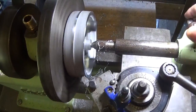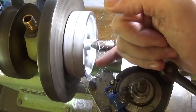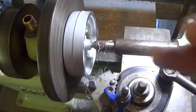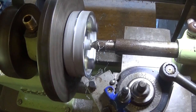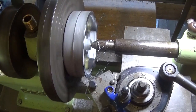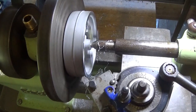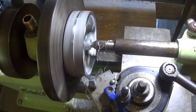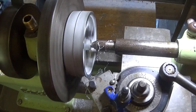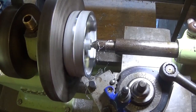I've cleaned up the outside and my boy was right — castings are beautiful, they machine like magic. Just zinc aluminium. I've trued this up but I'm truing the face up and it's got a bit of a peak in the middle. This shape is because of the draft angle for the casting — the pattern is cast in two bits. If you haven't had a look, go and have a look at Myford Boy's videos about casting these castings. They're fantastic videos and they show you pretty well what the process is that he goes through to make these castings. They are quite involved, and they explain the shapes and what they are and the machining operations to finish it.